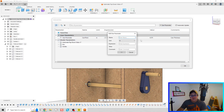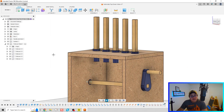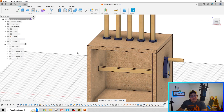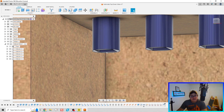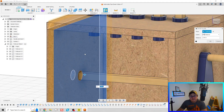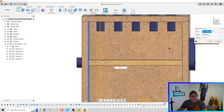We're going to add another parameter and call it 'nom_dia' — for right now I'm just going to set this to one inch, with description 'nominal diameter.' From here we're going to start modeling our cams from left to right, but we need an offset plane. To measure out the distance, I want it to be the center of this hole to the left wall. Let's click on Offset Plane — dragging it over, it looks like it's going to be about a half inch.